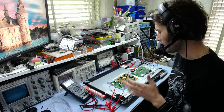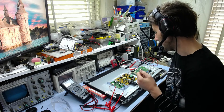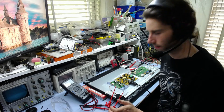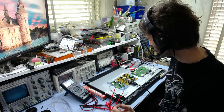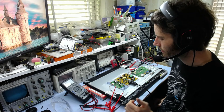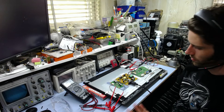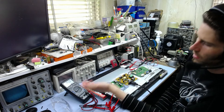What I've done is soldered wires onto all three voltage rails in the power supply. This power supply provides a 5V rail, a 3.3V rail, and what I call an 18V rail — it changes depending on load, about 16V when the backlights are running and about 20V when they're not. I'm measuring all three at once. When you apply power and turn it on, you can see the power LED comes on — we've got 3.3V, 5V, and 16.6V here. You can see the backlight coming out from the edge of the panel, and there's an image — a 'no signal input' message bouncing around the screen.